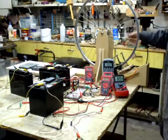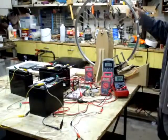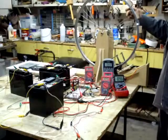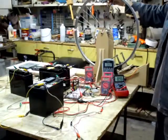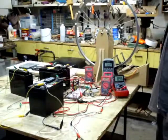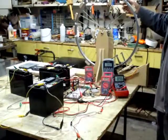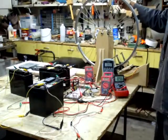I also added a few more magnets to the wheel so I've got 18 of them on here now, and they're all spaced 20 degrees apart. I've been spinning it the other way now where it draws more current but puts out more energy, because I've been getting much better results on the battery charging side — getting way more milliamps out of it. It's not drawing as much, probably because I've tuned it fairly well, and I might be able to lower the draw end of it some more.